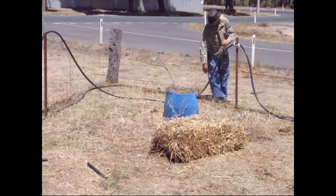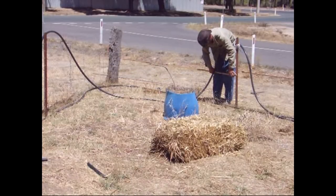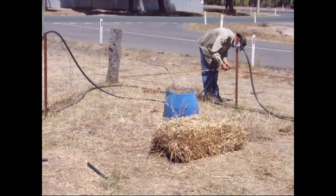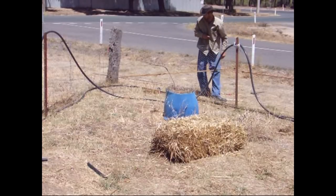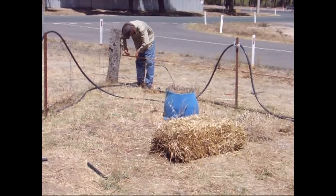What you can see me doing here is I've laid a string line to get a consistent rise, and then I'm using battens of wood to keep that poly pipe straight — not flat, but straight — a straight inclined shallow rise. And keep it that way, especially as the hot poly heats up, expands and gets all wibbly and wobbly. You really need something rigid to hold it in place, or lots of string, because you need to be able to adjust it.